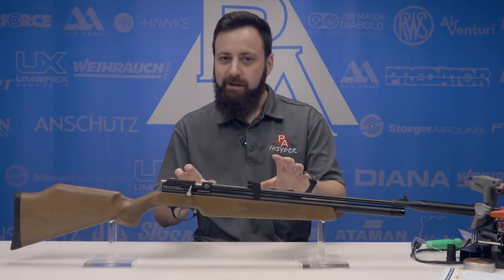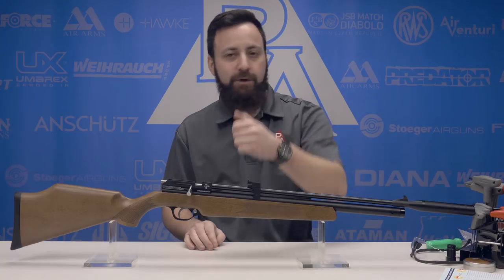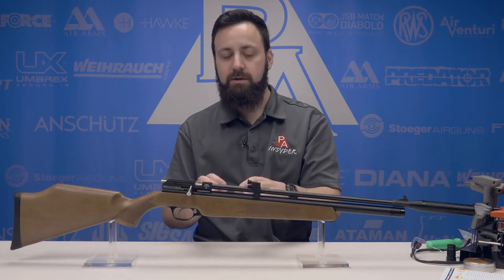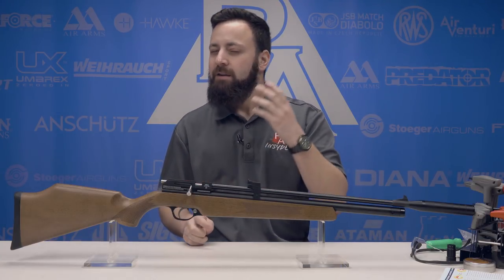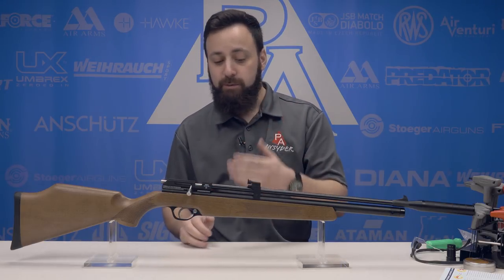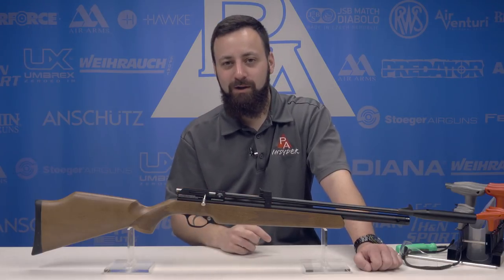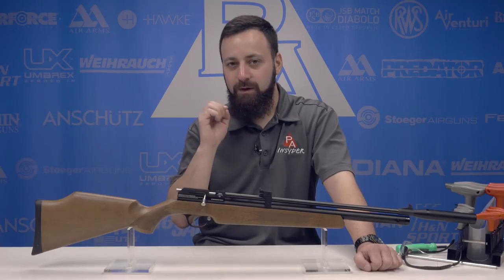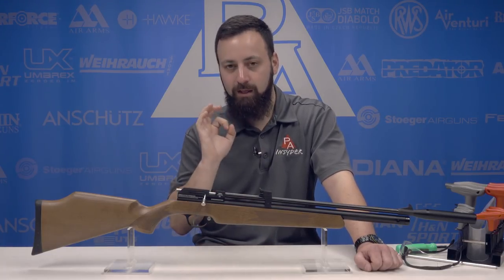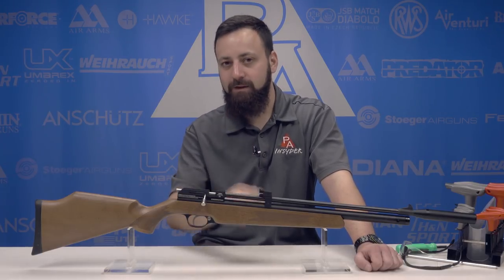That about wraps it up for the Storm Rider regulator install — very easy to do. When you get the regulator kit, make sure you're picking up the gauge fill assembly piece as well. We'll link both down in the description. For you Bandit owners also, the regulator certainly will work there as well — check that out to get a little better performance. I really like the adjustability of this unit, really allowing you to fine-tune the output power level of your Storm Rider. It's a little bit more applicable in .177 than maybe .22, but it definitely flattens out that shot curve and gives you a solid number of good usable shots for a very small cylinder. Whether you're a Gen 1 or Gen 2 Storm Rider owner, or if you're a Bandit owner, this is a great upgrade you're going to want to look into. It is a solid performer and gives you a lot of possibilities in terms of how you want to set up your gun. Really pleased to see Diana come out with something like this, really owning that aftermarket. Check it out on pyramidair.com, and don't forget to like, comment, and subscribe. I'm Tyler Patner — thanks for watching, and we'll see you at the next one.